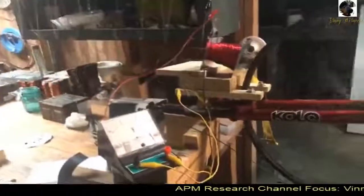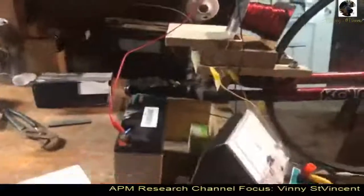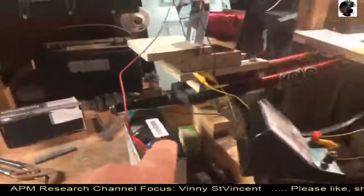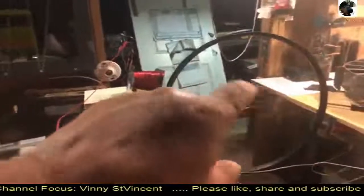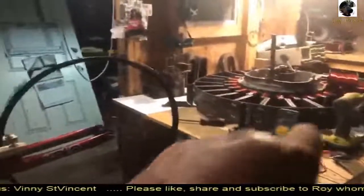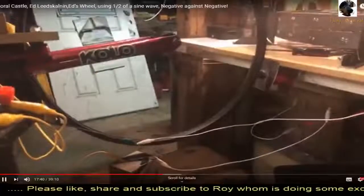And then this side right here is just recording the back EMF off of that coil, and just using a 12-volt battery. I have to get some batteries for this. And what I want to do on the next video we do live, we'll show current that we're driving the motors with, and then we're going to put current on the output and try to match the current coming out as the current coming in. It's the only thing I can do to really verify power in, power out, right?